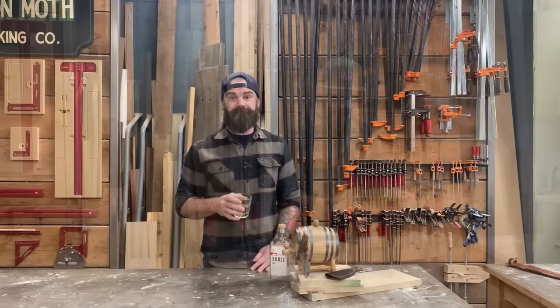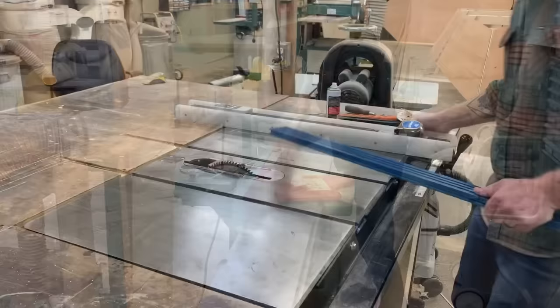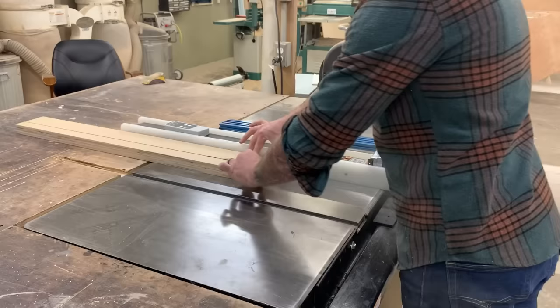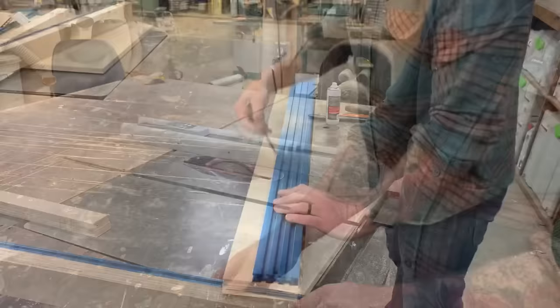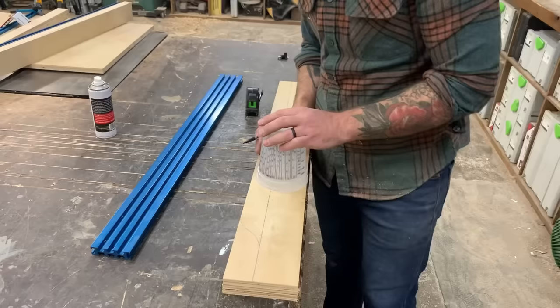After a few hours of clowning around the shop, my glue was sufficiently dry. So I took my brace pieces out of clamps and started working on cleaning them up. First, I ran each piece through the jointer to get a nice straight edge and get rid of all that glue. Next, I wanted to cut down my front fence piece. I wanted this fence piece to be the exact same height as my aluminum piece so that they nested nicely against each other. So I ripped my front piece down to exactly the same height as that piece of aluminum. This will also allow my stop to run smoothly without running into the fence.